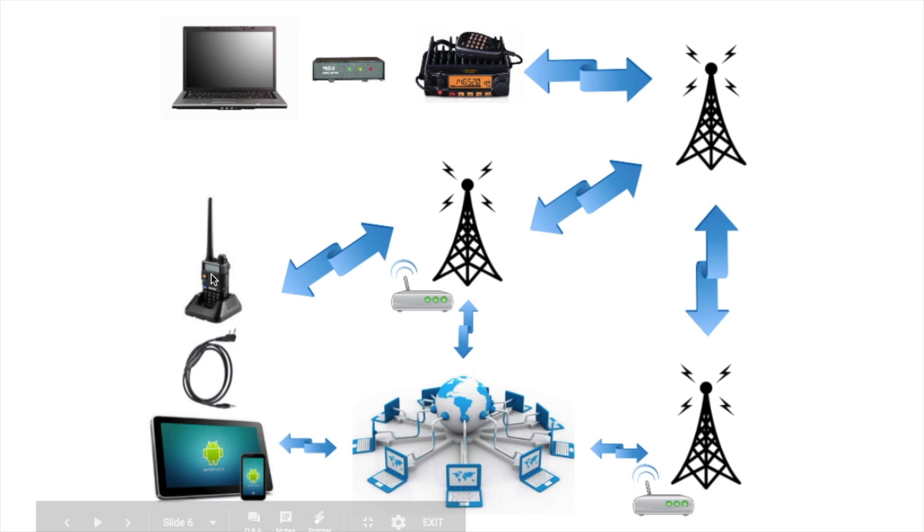Along the bottom of the diagram, you can see that using the Android tablet, you can actually feed your APRS information directly into the internet without the use of a radio. The topology is a little bit confusing, but you need to understand that it's made up of an APRS client, a TNC or node controller, a radio, and then you connect to a digipeater to rebroadcast your signal over RF or connect it through the internet.